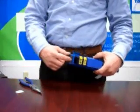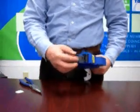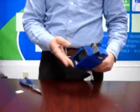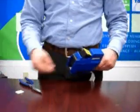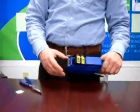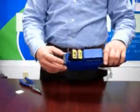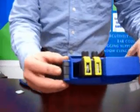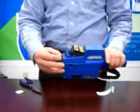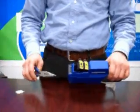You'll notice there are some grooves right here on the inker assembly. The inker assembly kind of moves up — it's spring loaded as you squeeze the trigger — but these grooves are actually the latch that holds the inker assembly onto the body, onto the frame of the label gun. These little grooves are what need to be squeezed in order to remove the inker assembly.